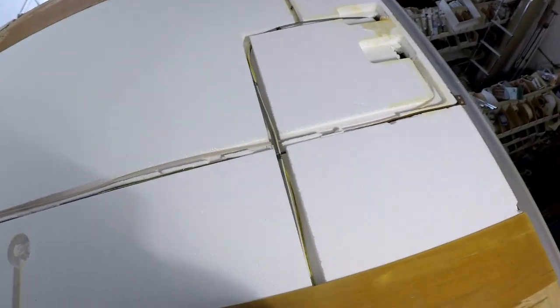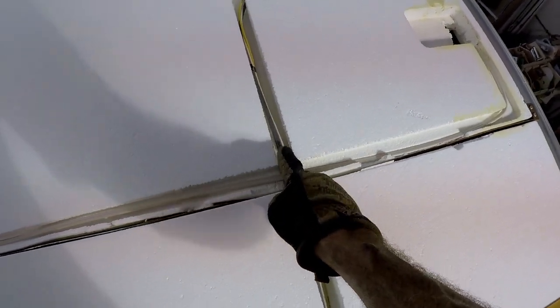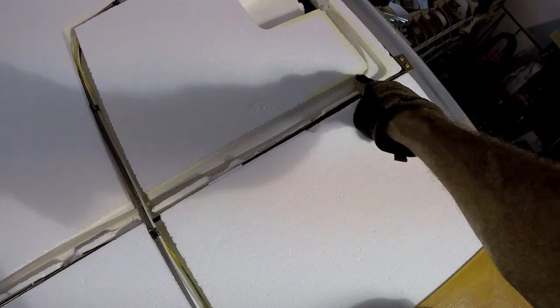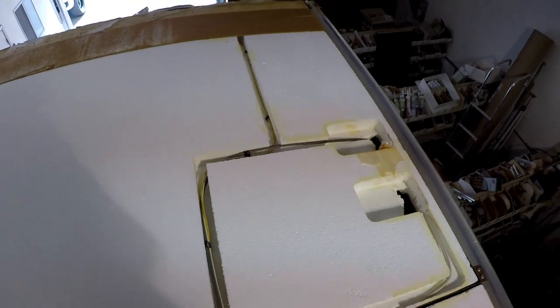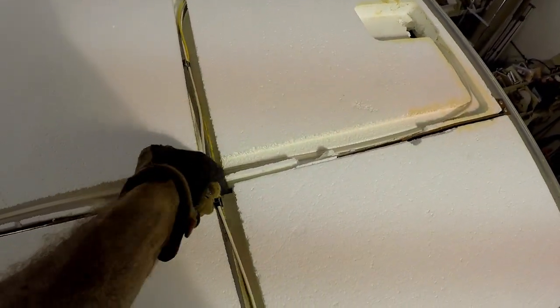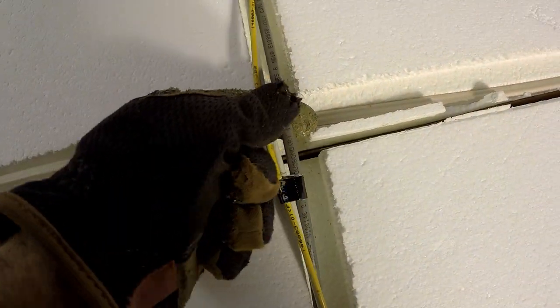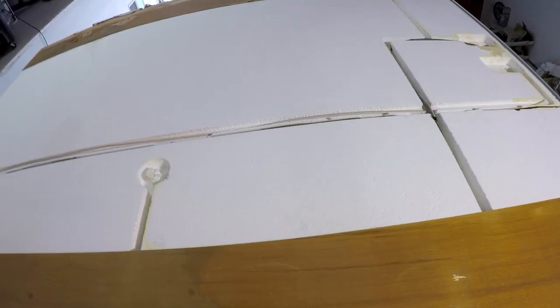Well, the first one's off. You can see it separates pretty nicely. It's just the coax pre-wire or wire to the bedroom TV. It's Romex to the bedroom TV. And not sure what that 12 volts is going to go to. Nice thing about Winnebago is if you ever had a question, you can just look on their wire. It has a code on it and it tells you exactly what it goes to. So this is circuit JD2.